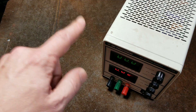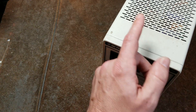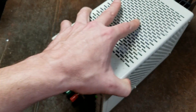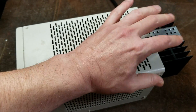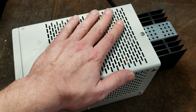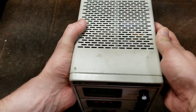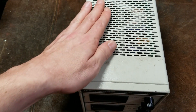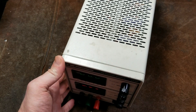I'll take a quick look inside this just to show people what's inside one of these power supplies. Many have fans. This one is passively cooled because it runs all the power through a transistor to regulate it in such a precise fashion — that transistor gets very hot. So this one has a very big heat sink. When you're running this at 90 watts of output on a fanless heat sink, that heat sink is like 120 degrees. I actually put a little fan on if I'm ever using it that hard.